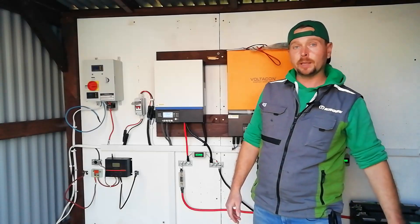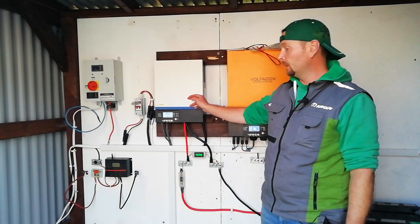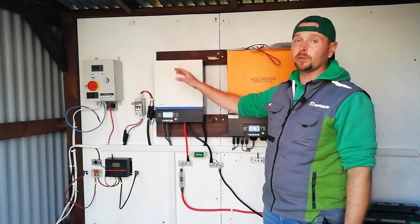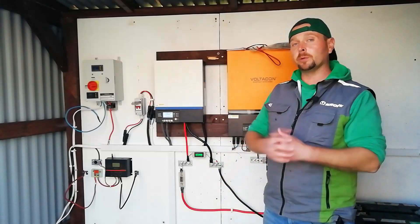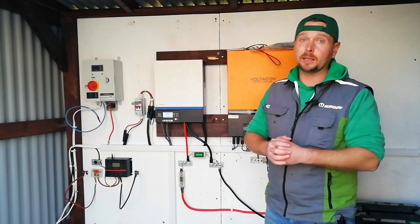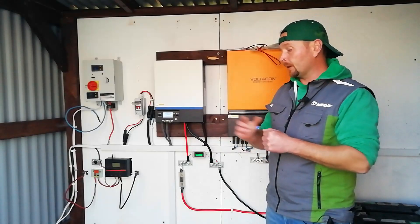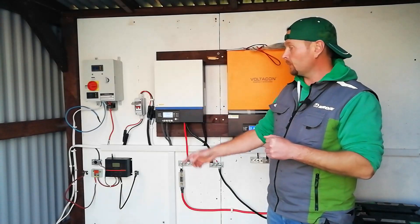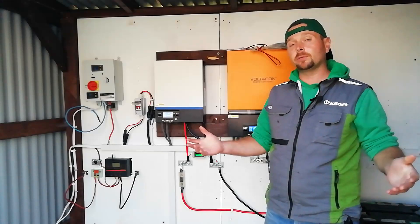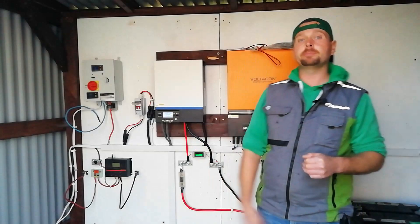That wasn't a total bust — we do have a full battery bank up and running again, albeit separated. So we've got a 48 volt system backed up by a 24 volt system with a 12 volt system as a charger, and we can add the wind turbine back in later when I have enough money saved up for a concrete foundation and an electric winch. I'm going to have to get a voltage regulator for the generator and put it in between the generator and the 24 volt. But other than that, thanks for joining me — the mission continues, take care of yourselves, and I'll see you in the next one.